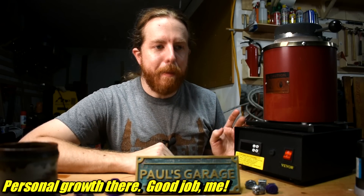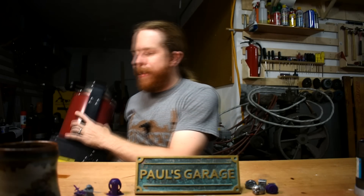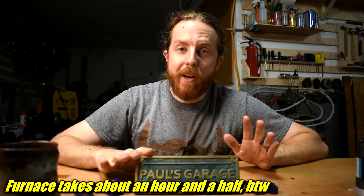This is important with investment casting because sand casting has some wiggle room as far as pouring temperatures, but investment casting has a much smaller acceptable range. So you want something that can actually control and zero in on that temperature. These electric ovens are fantastic. And actually, buying this is cheaper than just buying the bricks for the foundry furnace I built. Time it so the burnout is done and holding at the right temperature and the metal is melted in the furnace at the same time. Pour it in and go have a drink, because you've just done a lot of work.